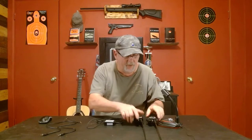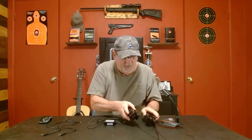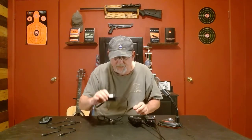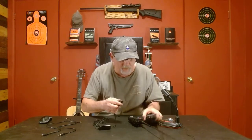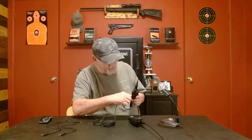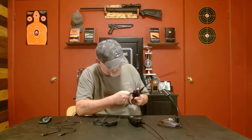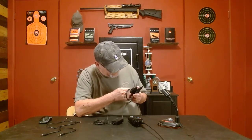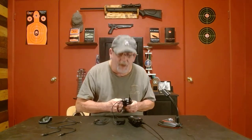What we've got to do is connect these two radios together — use one for a receiver, one for a transmitter. They do make a box you can buy; Feil actually makes and sells these so you can just hook them right into your radio, right where your program cable would go or your microphone, and just plug right into the side of the radio, just like that.